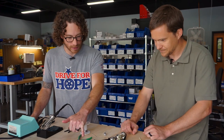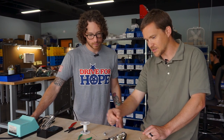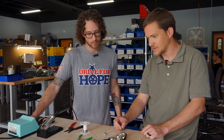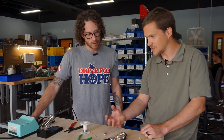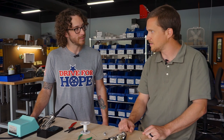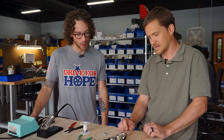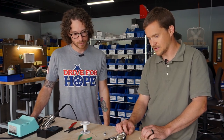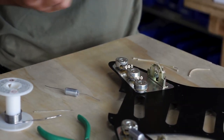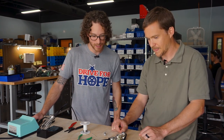So when you're soldering to the side of a pot like this, a volume pot, do we need to score that up a little bit? The CTS pots you don't have to — they're solderable. Most of your nicer electronics are easier to solder to. A lot of the overseas stuff, they'll zinc plate the pots or put this crazy coating on it and you have to sand or file it before you actually solder to it. So CTS, CRL, Switchcraft — those kinds of components, you don't have to sand or scuff up. They'll take solder. We get those off the website as well.